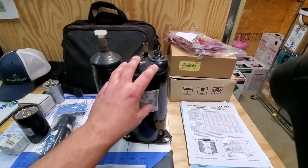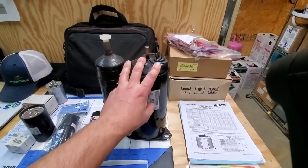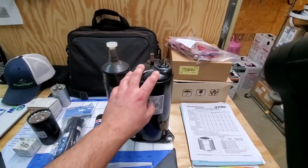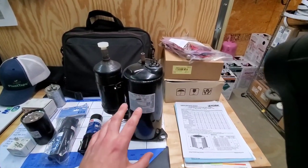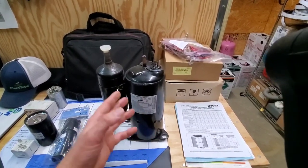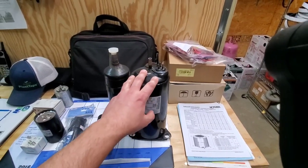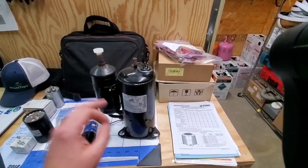Your air conditioning system has a compressor, and this is the biggest motor in the system — it pulls the most amperage or current. This is where your problem lies; this is actually what's causing the lights to dim. I'm going to teach you what you can do to help this compressor last longer and to keep it from dimming your lights. There's full load amps, or rated load amps, and there is locked rotor amps. Locked rotor amps is what the compressor pulls when it first starts turning the rotor. Full load amps is established after the compressor starts, and the locked rotor amperage is usually two to six times that of the full load amps.